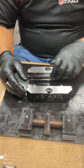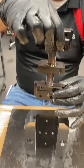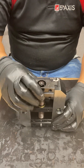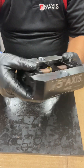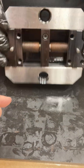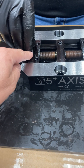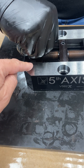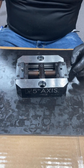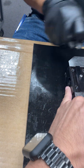Without threading them in any further, we're going to turn the vise over and install it. The right side is the one where the lead screw has a little hole at the end. We're just dropping it in place — basically replacing the guts of the vise, and that's all. Now we have our lead screw replacement kit with everything and trucks installed. Remember, the trucks on these X vises have a keyed entry, so you have to have these locating pins for the jaws to be properly installed and give the rigidity we promise our customers.